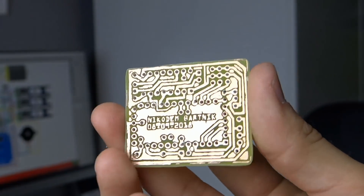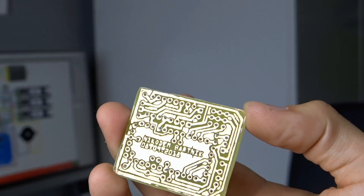That's a big one — I made it using a thermo transfer method at home. I haven't been doing that for a very long time but I still know how to do this, and this PCB turned out okay. It's not perfect but it should easily work fine. You cannot really compare it to a professionally manufactured PCB but I didn't have time to order one so I had to make it like this. I'm still waiting for my glue to dry so I will start soldering this PCB now.